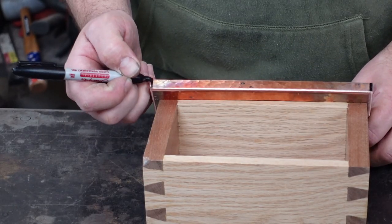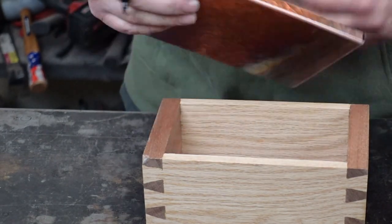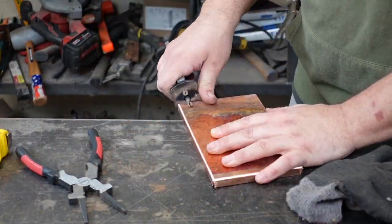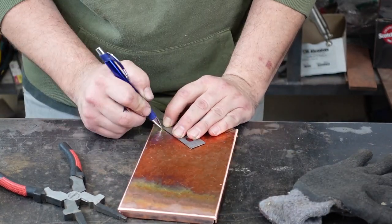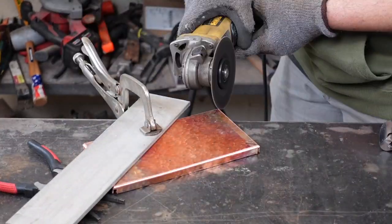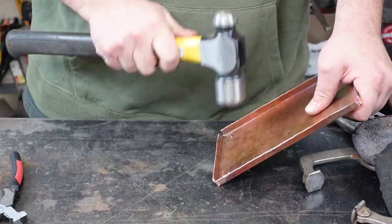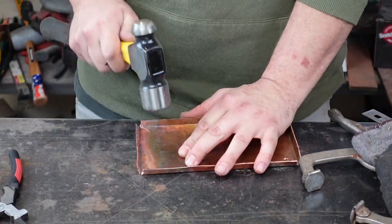I'm marking the corners about 3/16ths on each side because that's about the amount of gap I want to take out all the way around. I'm going to go ahead and remove the waste that I marked with the cutoff wheel. Marking a new brake line with the scratch gauge, scribing a line at 45 degrees to remove a little bit of material to allow for the new brake, and removing that line with the cutoff wheel. Then I need to go ahead and bend back the flanges slightly because we're going to add the other brake. So instead of having 90 degrees right here we're going to bend this back to about 60 degrees and then add a 30 degree brake making 90 degrees again.